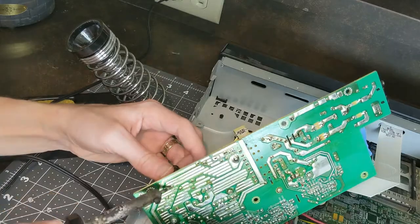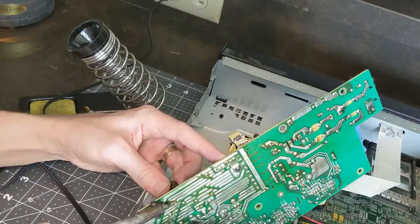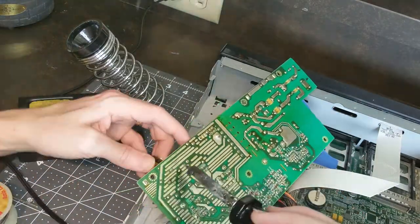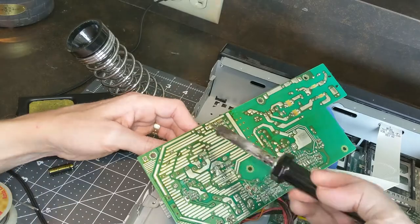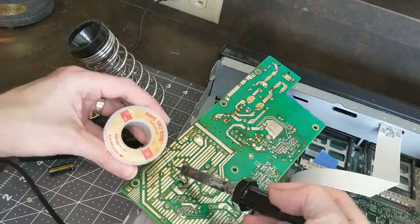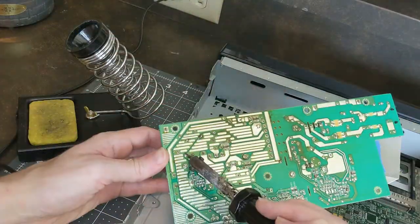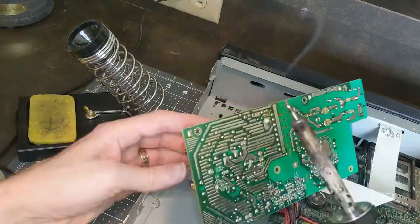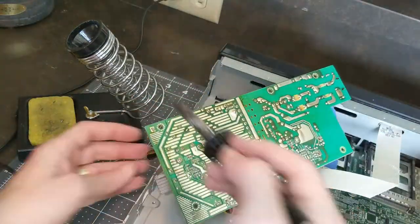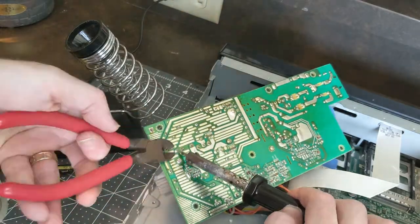This is sped up a lot, but what you're seeing here is heating up the capacitors from the underside where they make the connection to the board. After heating them up, it loosens and softens the solder, and you can start to wiggle them free and pull them out. There are several different capacitors here that I'm doing this on — those three that were bulging basically. I have to put the soldering iron against it, warm it up, and wiggle them out.